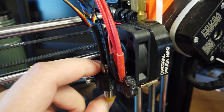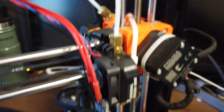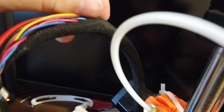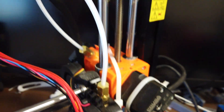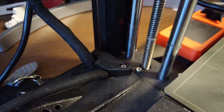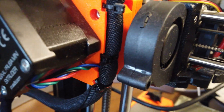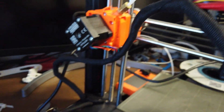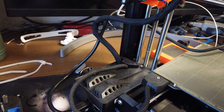Something I just discovered — you can actually just push it down and up. I should have realized that; I've had to adjust the height of this sensor before when I first got the machine. So now we've got to fish it all the way out of here. Back here there's a zip tie that needs to be cut, and another one down here, and then we'll go down to the base and plug in the new one. So rotating around, you can see the cable ties — those three there, there, and there. Going to go ahead and take those apart now, cut all those zip ties, and pull apart the sheath.